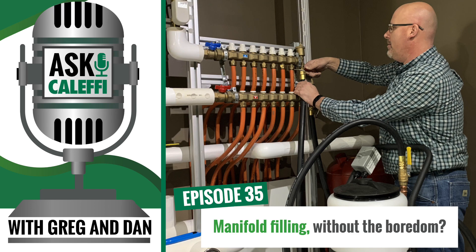A lot of guys are used to filling right in through the boiler fill on the boiler side — and you can do that, but it might take longer. I almost guarantee it will take longer versus using the purge valves that we offer with the manifold, right below the air vent. If you've looked at our 663 or 668 series manifolds, on the supply inlet and return outlet going to your system, we have ball valves so you can shut off and isolate that manifold. On the other end, we have an auto air vent on the supply and return side and a boiler drain — so you have a way in and a way out, with garden hose connections.